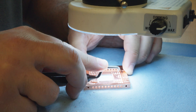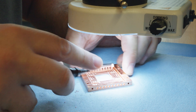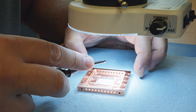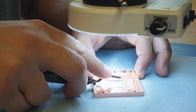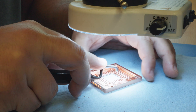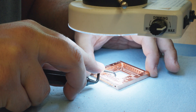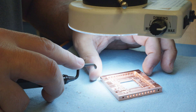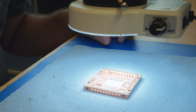I actually used a brand new eighth-inch end mill here, and there are basically no burrs. It's essentially perfect in here. This goes to show how much even minor wear and tear on your end mill, with a material like copper, is really going to make a big difference in the burrs left behind. In this case it's essentially perfect — I really don't need to go in and do anything. It looks amazing. In the next video: gold plating.